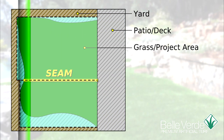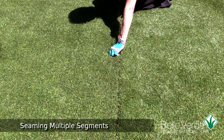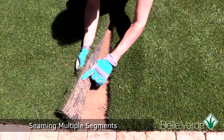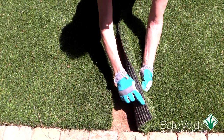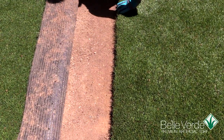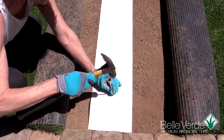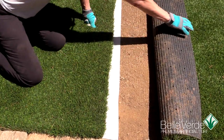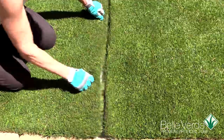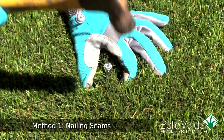The project we've been building uses a single piece of turf. Well, what if you needed to seam two or more pieces together for your project? Let's take a look at two different seaming options. You'll lay out the first piece of grass and smooth it into place, then lay down the second piece and adjust them to fit the area. Look closely between the pieces and adjust the spacing to equal the space between the tufted rows of blades. For nailing a seam with seam spikes, roll the turf back at each edge and bring the seam fabric in, tack it in place using a seam spike, then roll it out and cut the length as needed. Your first seam option is to use six-inch seaming spikes, which you will want to add along the seam every four or so inches by tapping them in diagonally on either side.